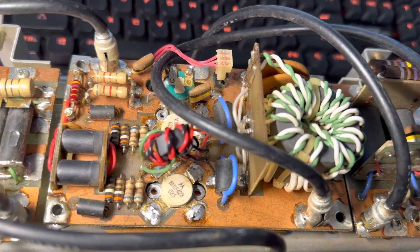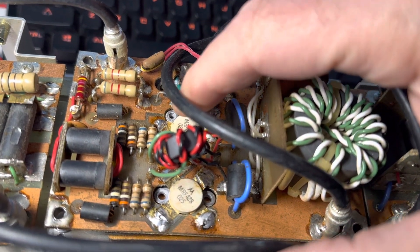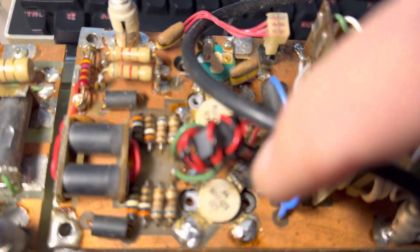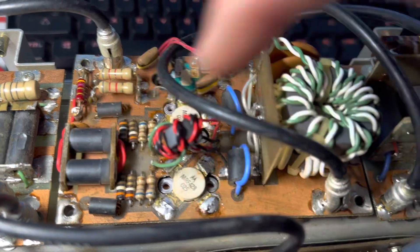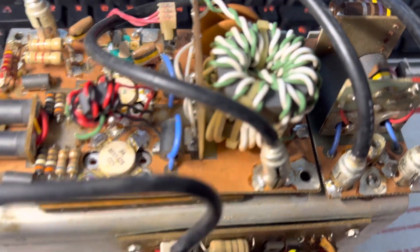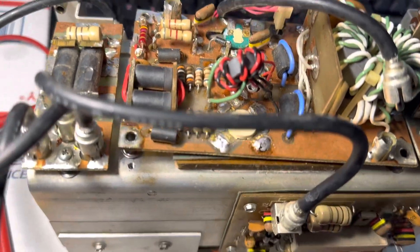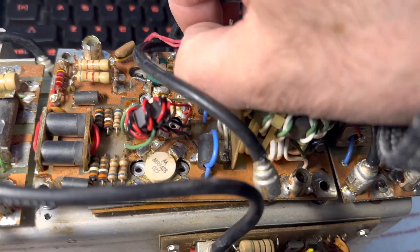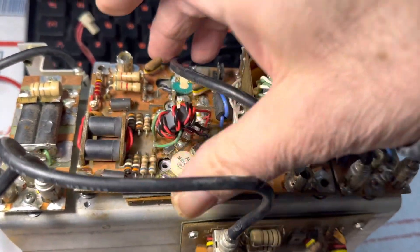To get this thing out, you want to take out the screws that screw in the temp sensor here, two screws for this guy, two screws for that one. You take those out, take the four screws out in the corners of this board, take out the connectors - there's a connector here you can take off, and one here, and take off this little plug that goes to the bias board. Then you can more or less lift off this board.